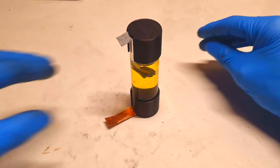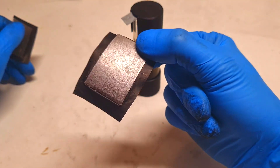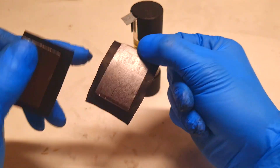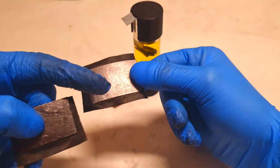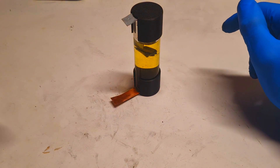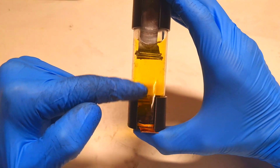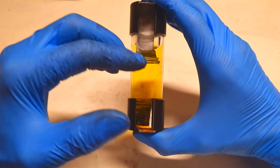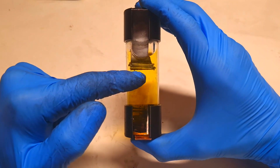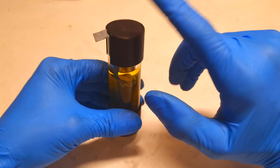For this reason you can use a positive current collector which is made from conductive HDPE and graphite foil, where the conductive HDPE is welded on the surface of the graphite foil. This will be a really good current collector because it has really nice conductivity. The last thing you can do is put some conductive network — like conductive carbon foam or felt — in the area where the bromine is created. This will also boost the performance of this kind of battery.